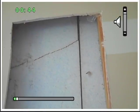Another example of cracking foam exterior. You can see the siding through there. And what I did was, I don't cut right to remove all this trim. So I cut this with my oscillating tool, glue this on with my clamps, and then 3X glue premium, holds it like a rock, and I'll foam that and glue that piece on there so I can support that drywall, and we'll fix it up.